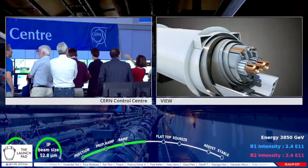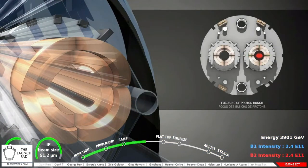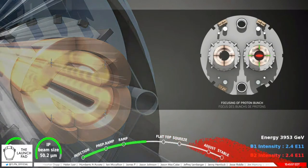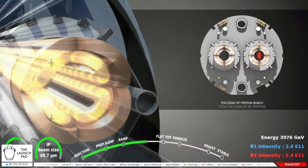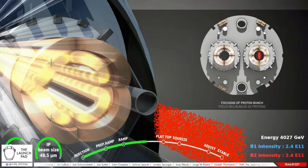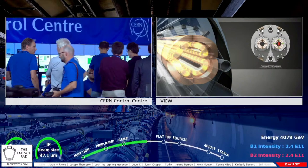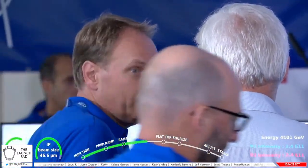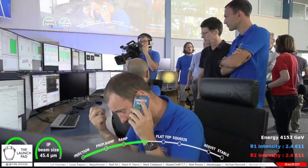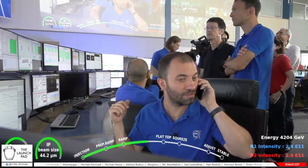There is another marvel of technology that is part of the core of the machine — the quadrupole. We have around 400 quadrupoles in the LHC. The standard quadrupoles are there for focusing the beam. The particles remain in the LHC and run nominally for around 10 hours — equivalent to going to Pluto and back in terms of distance. Anything slightly off trajectory will get lost. The quadrupoles maintain the beam trajectories so we don't lose particles on the wall. Dipoles bend the beam, quadrupoles focus the beam, making the beams stay focused over the whole distance.